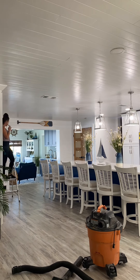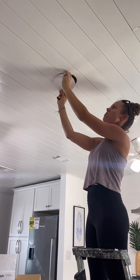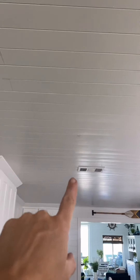The first thing I did is mapped out where my new lights were going to go. I am going to be drawing power from this existing LED light, so I just removed that and exposed the wires. To add new lights to my existing circuit I'm going to be running a wire to the first light and then to the second, third, and fourth.